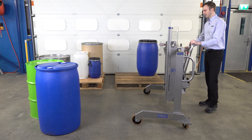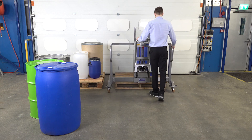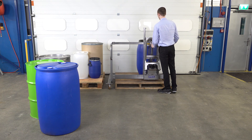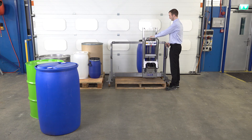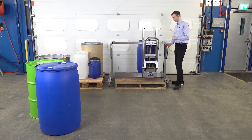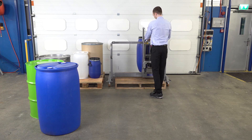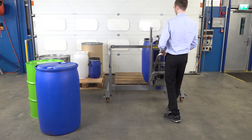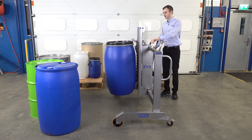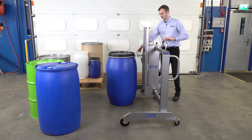We'll maneuver the unit towards the pallet once again, line the legs up with the left and right sides of the pallet, and bring the unit to pass over the top of the pallet — the pallet going under our machine. Lower our gripper down into position. It's always good to visually check the bottom hook and top hook to make sure they're in the correct position on the drum. All these drums are full of water so they weigh about 200 kilos each. We then lower it down to the ground, just enough that the weight comes off the hook, then lift it off and move our unit clear.